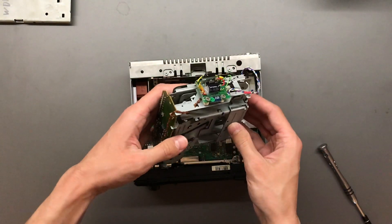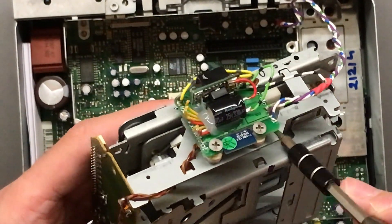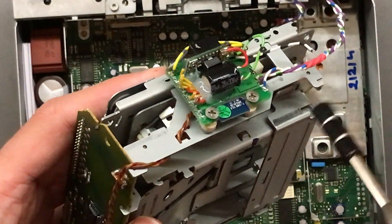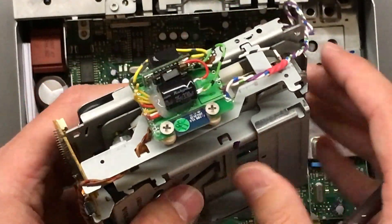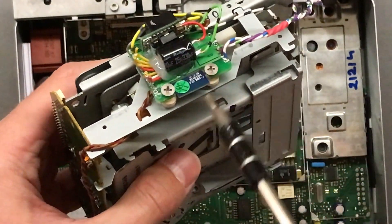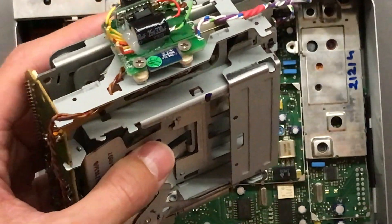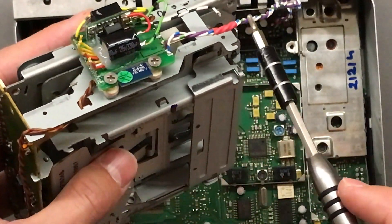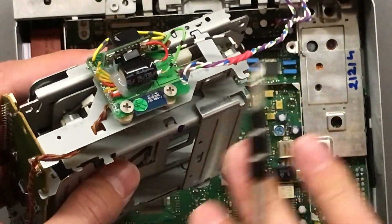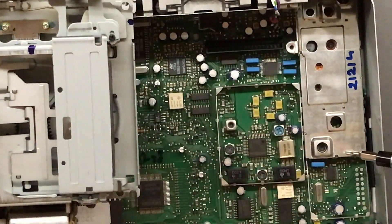Over here we have the CSR8645 board. We have some wires here that are just in case future programming is needed. I've already put a custom name on this. It doesn't have an equalizer because the CSR8645 actually doesn't have a robust equalizer — if you set it up for iPhones it will not work on Android devices because those don't use AAC streaming. If you set it up for Android, it'll have weird distortions when you skip through a song. So that's why it's very important to go through the on-board signal processing to get the equalizer and volume.